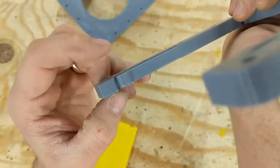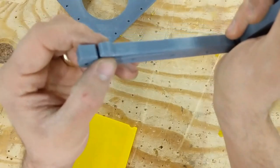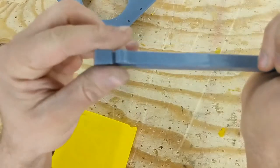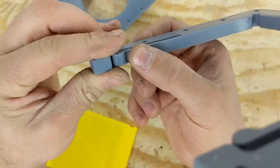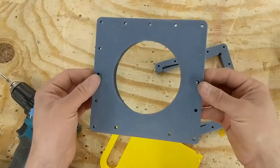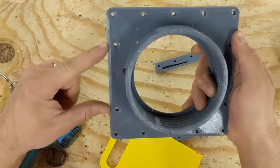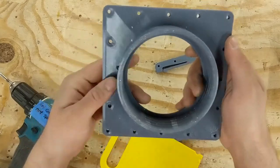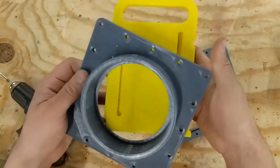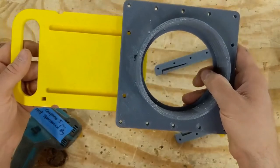The compliant mechanism has one layer of filament missing here and one layer of filament missing here, and that way when it's sandwiched between two plates it has clearance to move freely. The last piece is the bottom plate. There's not much to write home about here — it's just a mirror of the top plate with fewer features. These two holes here get threaded quarter-twenty, and then bolts go up through them to slide in these slots, and that keeps the door from getting pulled out too far accidentally.